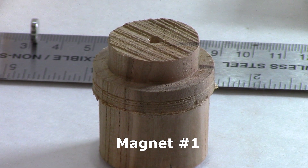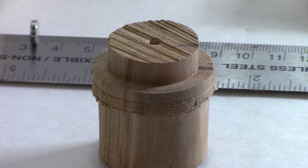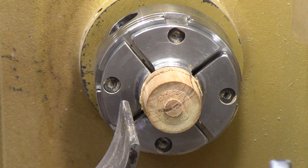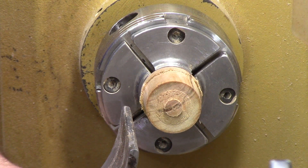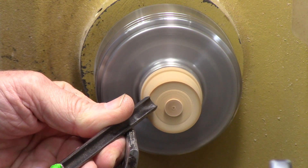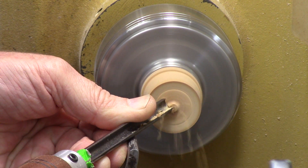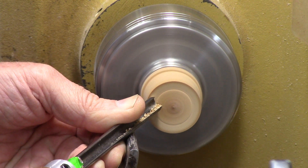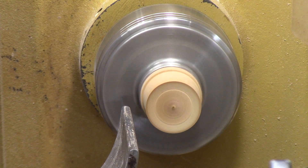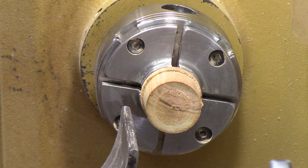The first one I'm going to make is out of this little cherry tenon scrap from my scrap box. It's maybe an inch and a half wide and an inch and three quarters long, and it already had a tenon on it. I've got that little cherry tenon scrap chucked up in my 35 millimeter jaws, and we're just going to face it off using this tiny little 3/8 inch bowl gouge. This is going to be the bottom, so I want to make sure it's fairly flat where it sits against the refrigerator — maybe just a tiny bit concave.